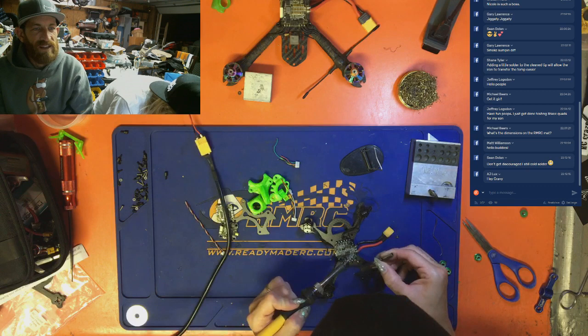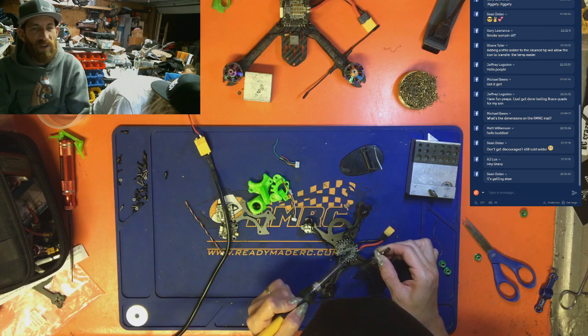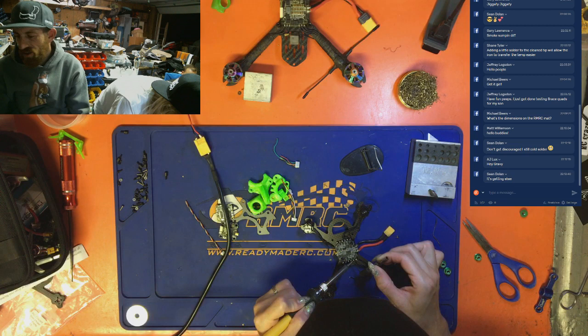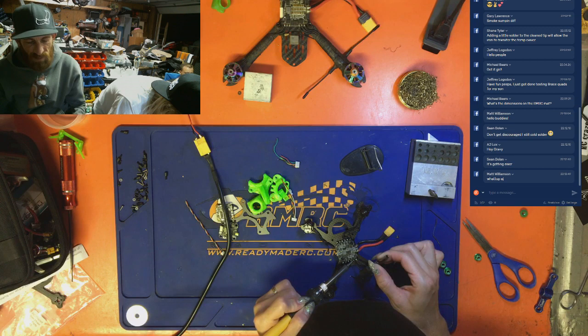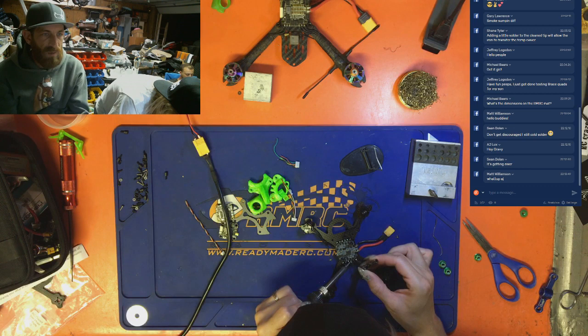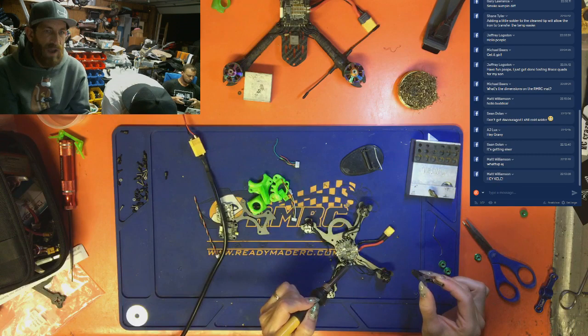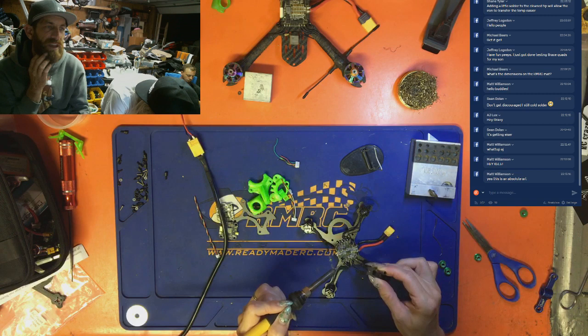Yeah, soldering is probably the hardest part of builds, perfecting the technique of making sure that everything is hot. My method is more, I will pre-tin and get nice big globs on there, so that when I hit it with the soldering iron and put the wire to it, I can hit it on the ESC, and when I touch the tinned wire to it, it basically sucks the wire into it. That is my technique for going into the ESCs and really any soldering.